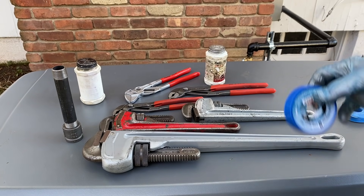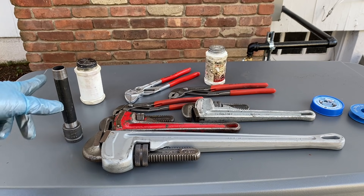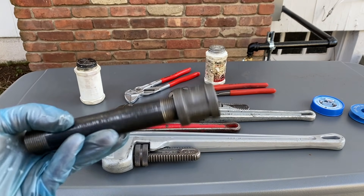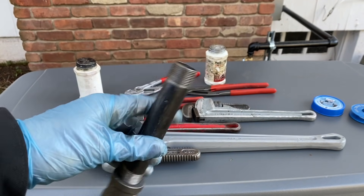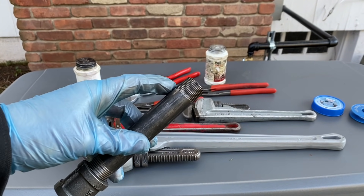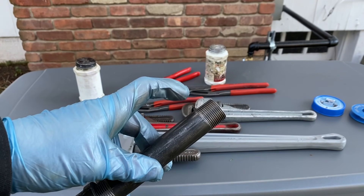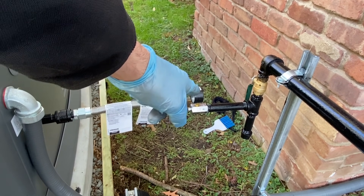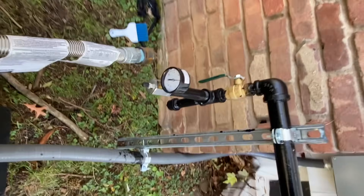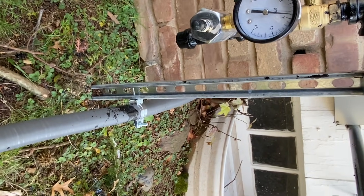But I still prefer to use the dope. Now let's quickly make a connection. What I'm going to do is see by hand which I can thread in further — a dry fitting or a fitting with some pipe sealant on it — because the pipe sealant lubricates and helps you tighten it more. It also compacts as you're tightening it, creating a better seal. I just passed my air test; I have pressure on my gas pipe — about 8 PSI.